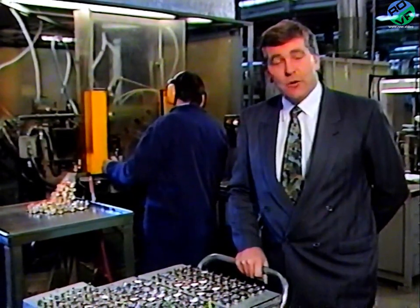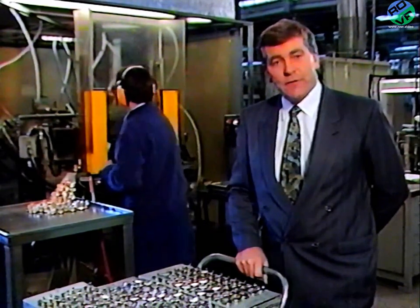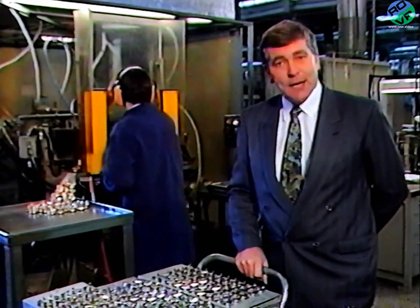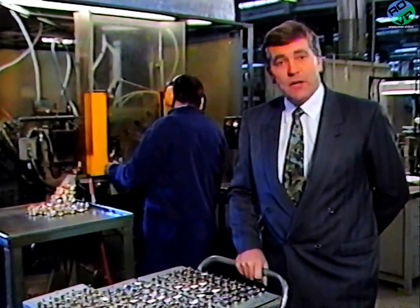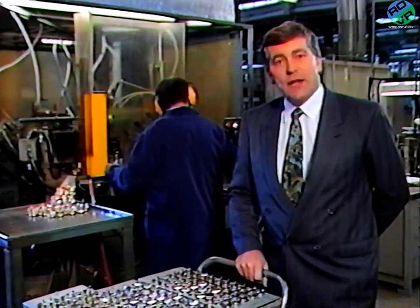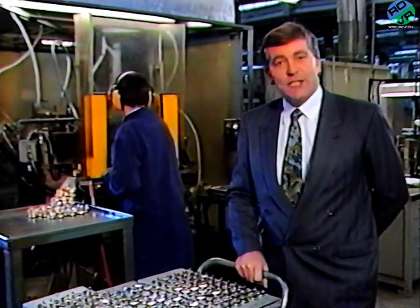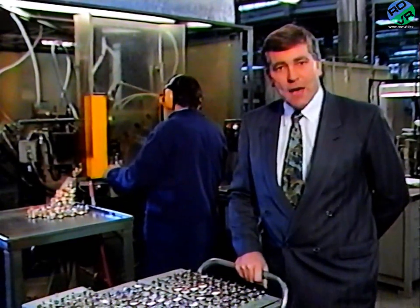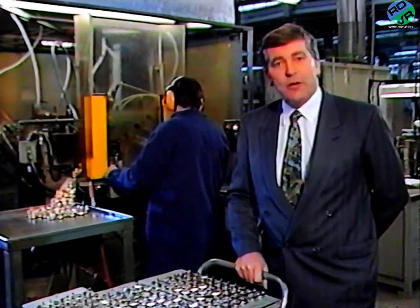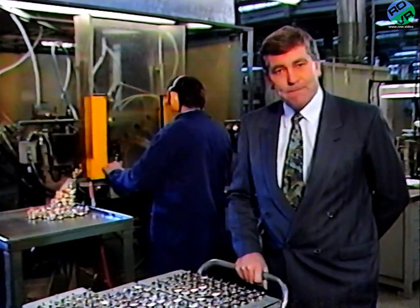High-volume, low-pressure, or HVLP as it's generally referred to, is not a new method of atomization, but is simply, as the name suggests, a change in the proportions in which the air is delivered to the gun. So let's look at one of the latest generations of HVLP guns, the DeVilbiss Duotech JGHV, and compare its basic air pressure and volume requirements with its conventional stablemate, the JGA.